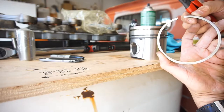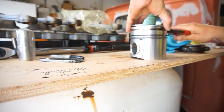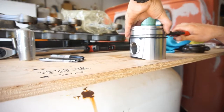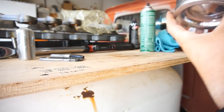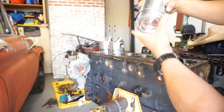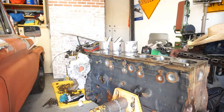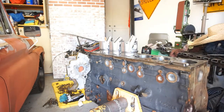Find the top marking again — this one's kind of hard to see, so figure out which is the top, stick it in the ring compressor tool. Then taking it over here, finding the 'front' marking on the piston — it says 'front' — and dropping it on the connecting rod. Then I take the wrist pin and the clips and put it right in there. That's basically what I'm doing right now — that's the video of it.